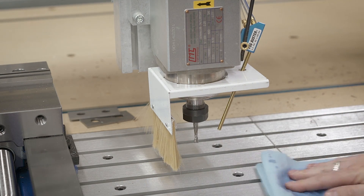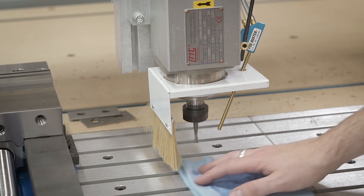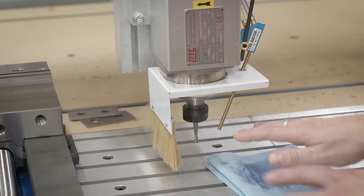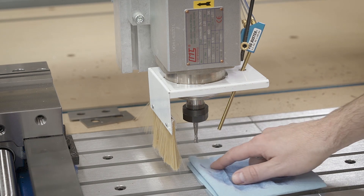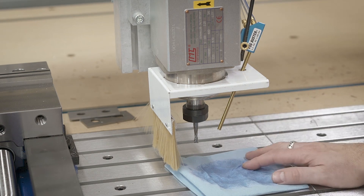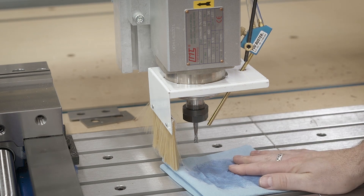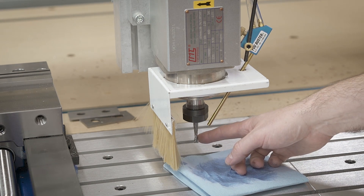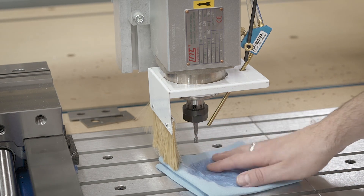It's just a little bit of coolant that comes out, and one of the nice advantages is it's very easy to clean up. With flood coolant your chips get really wet, you need some kind of evacuation through the channels in your table. With this setup I can keep the dust shoe on and still suck up the chips normally because they're really not soaked. By the time they go through the hose they're completely dry — this basically evaporates almost as soon as it hits the end mill. The air blast gets chips away from what you're cutting, and the small amount of coolant cools down the end mill so you're not heating up the end mill or the part. It's pretty ideal for cutting aluminum.